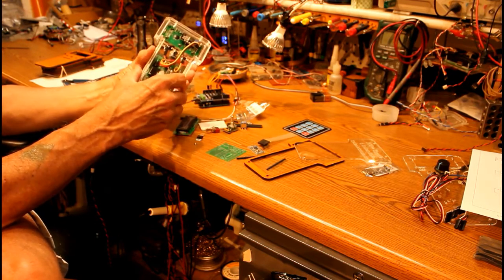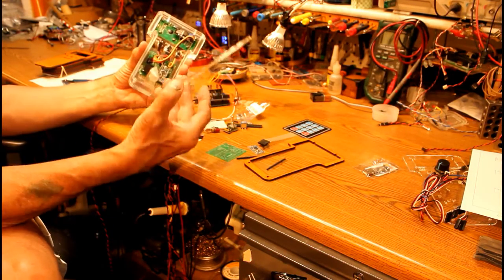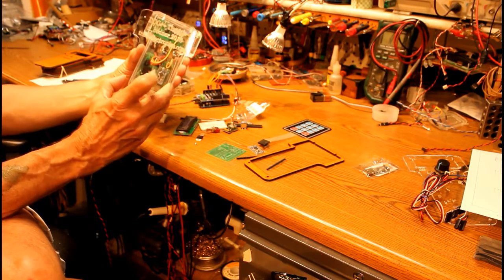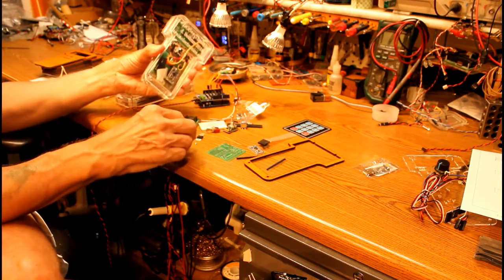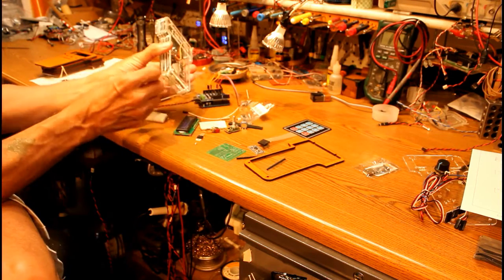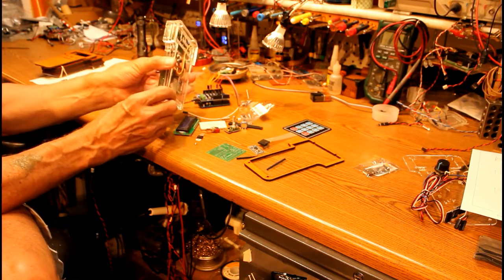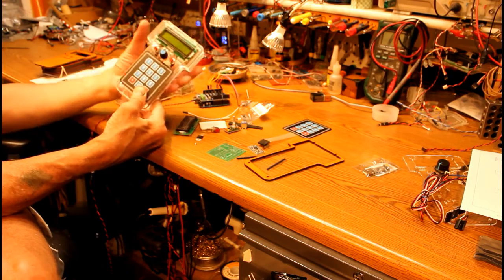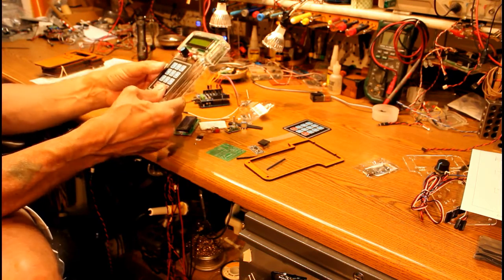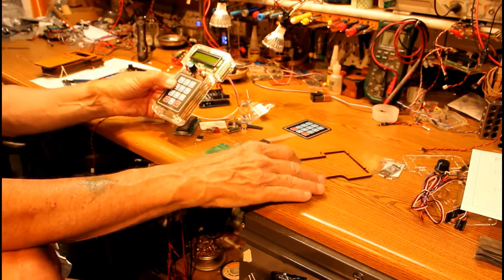Here's another 1/4 inch piece, and then the back is an 1/8 inch piece with a little labeling cut onto it. You put all those together, put a couple of bolts through and nuts on the back, and you've got a nice, easy to fit in the hand 3D case from a laser cutter. I'll show you a little bit more about the laser cutter in a few minutes.